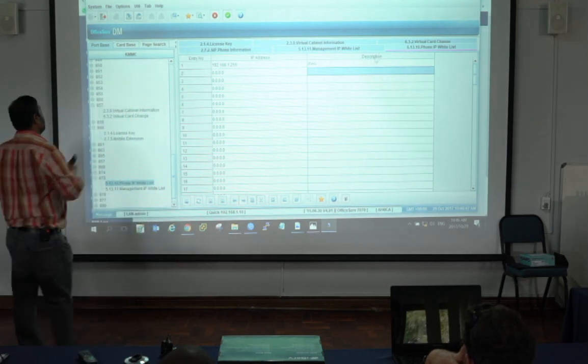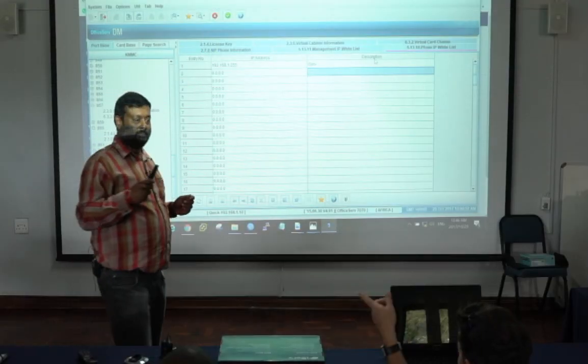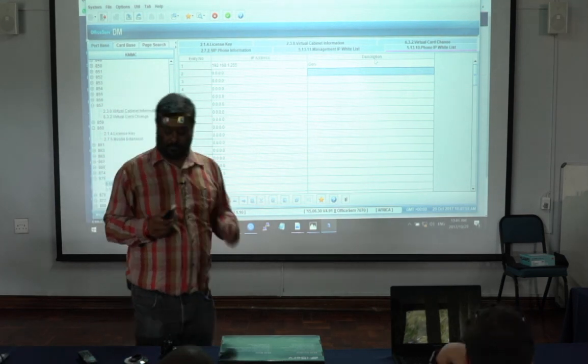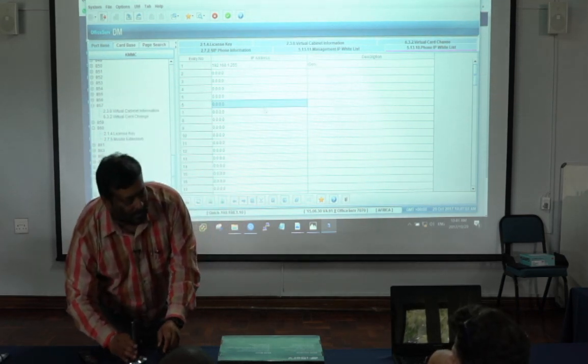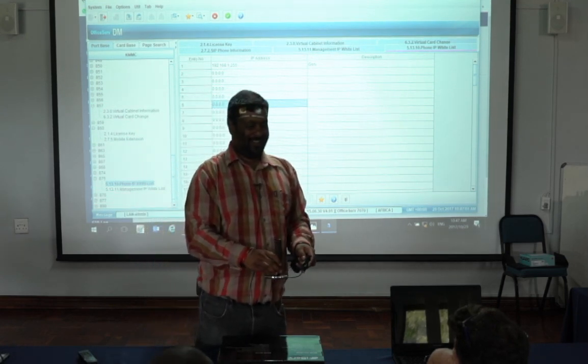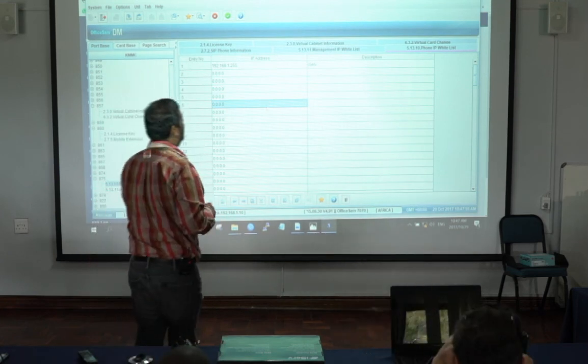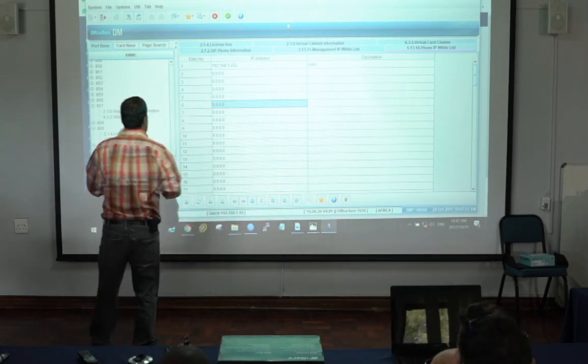Okay, so we have now configured our extensions on the system. We have whitelisted it. There should be no issue why this phone shouldn't work. Am I correct? No. You've still got to assign that to the base station. It's assigned. We have to set up the extensions on our iServe system at this point.